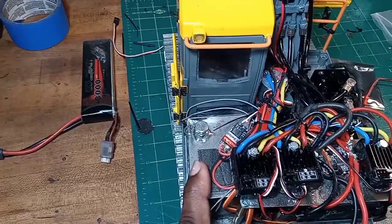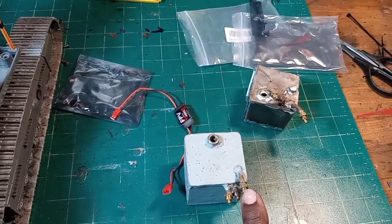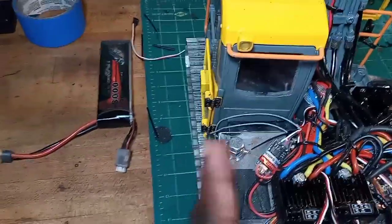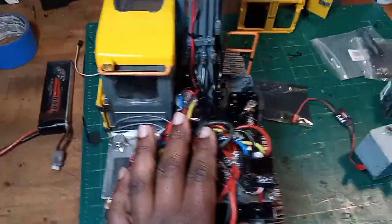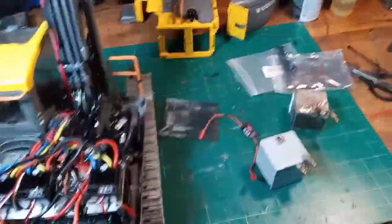I made a new bigger tank and it worked, but when the bypass valve was running again it started foaming the oil. After sitting and thinking about it, instead of trying to do something fancy with the return and bypass lines, I just went back to the basic way I've always done tanks — and this one works fine. The excavator itself works awesome.